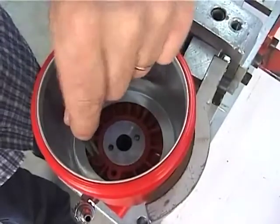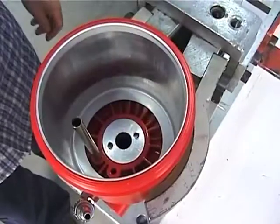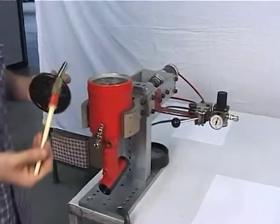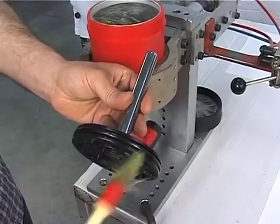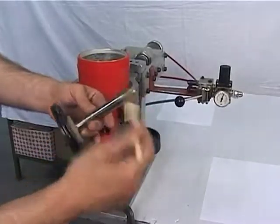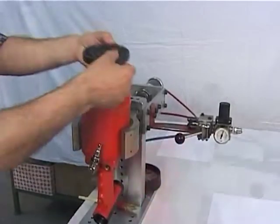Check that the tube, figure 73, is well fastened and the tool body sleeve is not scuffed. Grease the pneumatic piston as well as the tool body sleeve with high viscosity grease. Use a rubber hammer to insert the pneumatic piston into the tool body.